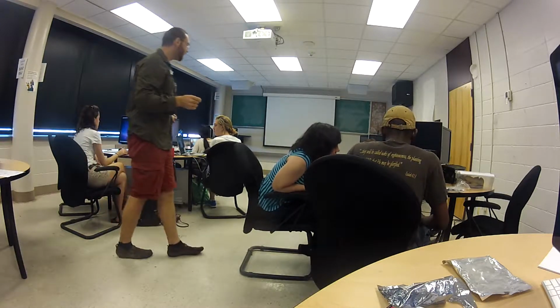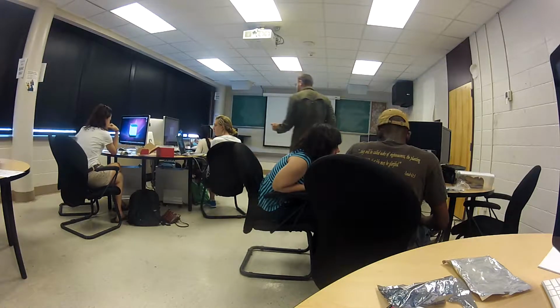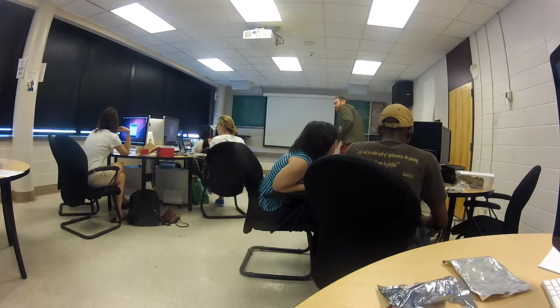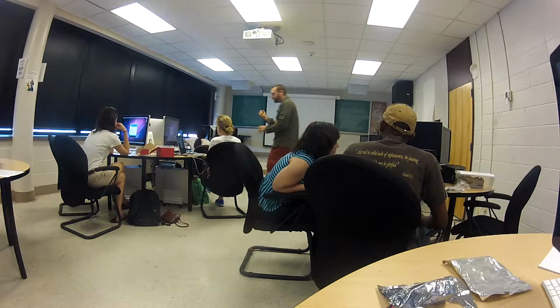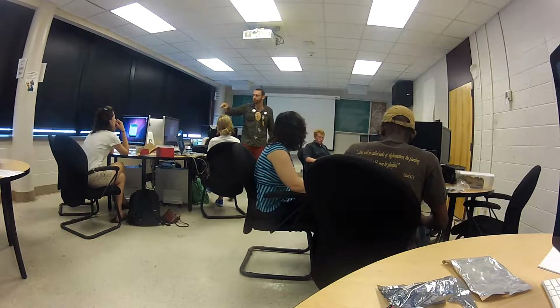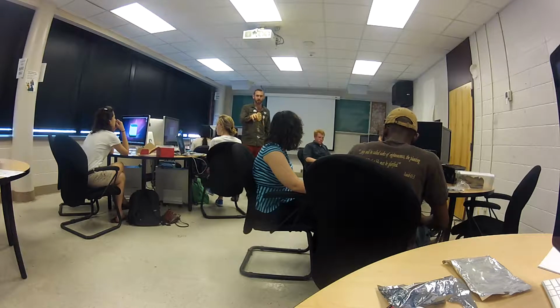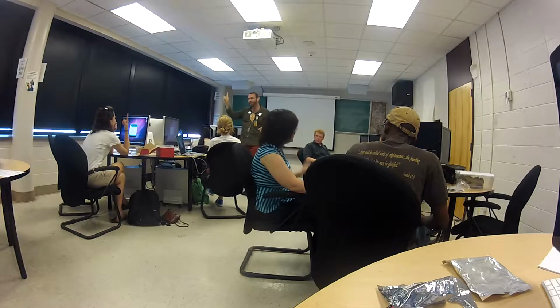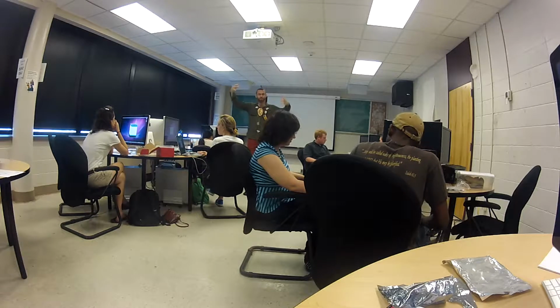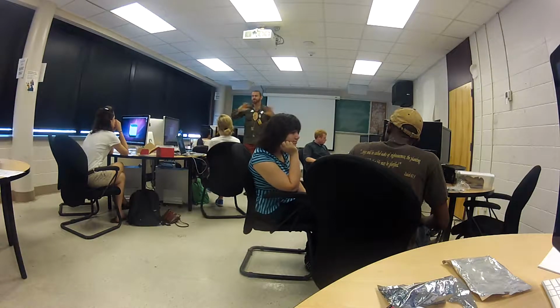So there's your setup. The way your Arduino works is once it has power, be it from the USB giving it power, or from an external battery, once it comes alive, it is going to run the program that you put onto it. This program will run the setup how many times do you think? Once, exactly. It's going to run it once at the exact moment that it starts up. After that, it's never going to touch the setup again. It's just going to endlessly do the loop.